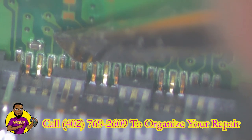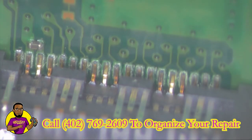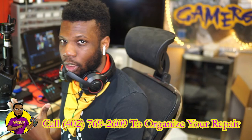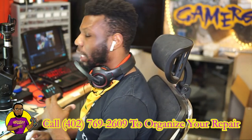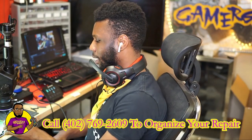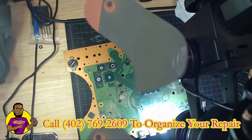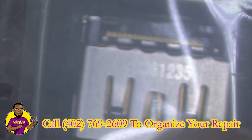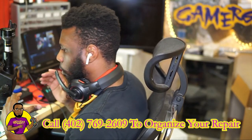You see that one moving — so we're going to need to do a couple things. I'm going to lift this HDMI port and I'm going to have to re-solder down all the solder points on the HDMI header itself to make sure every single pad is ready for the new HDMI port. I would not be using that old HDMI port because if it did damage like that, I'm not even going to risk putting it back in. I have the exact HDMI port to replace it — a brand new one versus our old one.